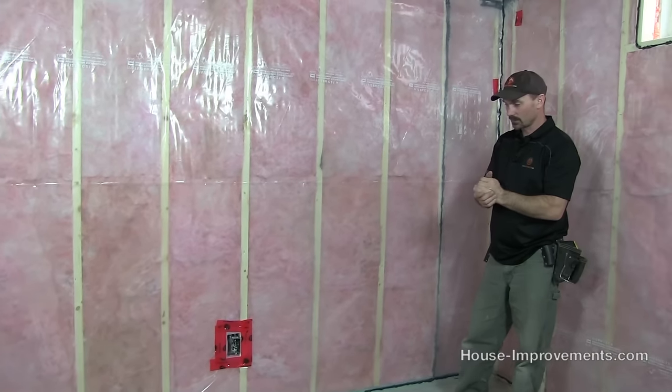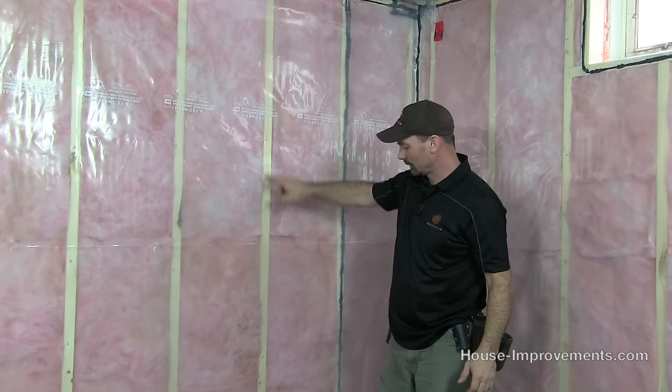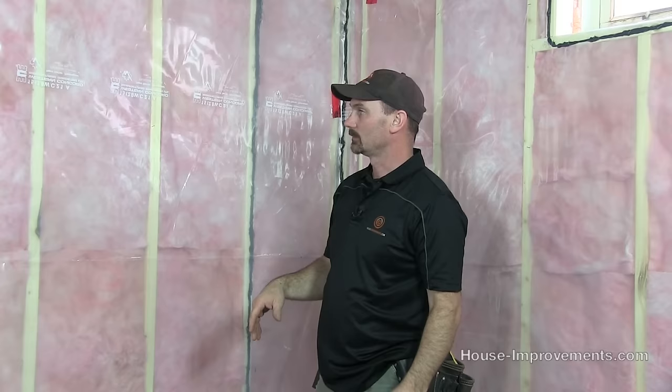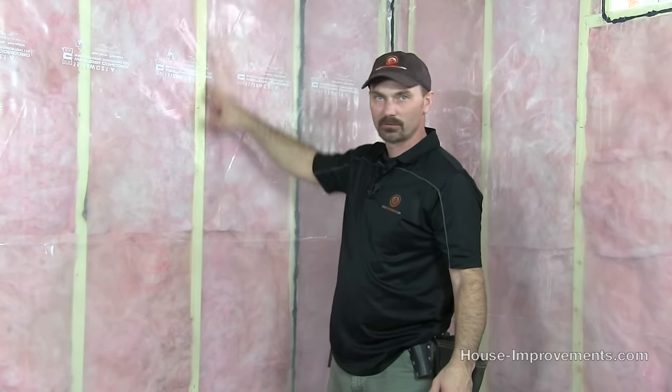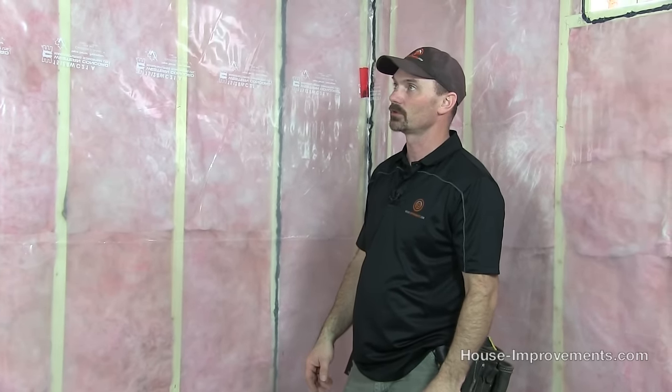One of the most important things is just to try to seal up as much as you can. Some people put tape on every one of their staples. I don't know that it's actually required by code, and it's not a bad idea, but that is one of the reasons why I don't overload it with staples — because less penetration is better. When you put your drywall up, it's going to puncture the poly with every screw anyway, but at least the drywall holds it tight to the stud and will help reduce the airflow and moisture flow.